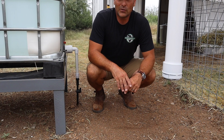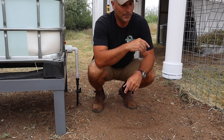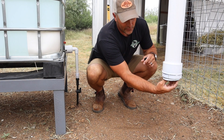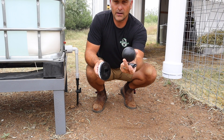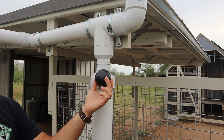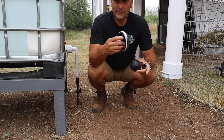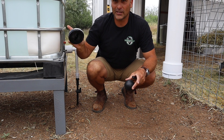For a little more info on the first flush for those who haven't seen my last rainwater harvesting install: the bottom of this first flush pipe has a threaded cap. Within this tube is a little black plastic ball that floats up with the water level and seals right at the connection where the PVC pipe steps down to the smaller diameter. That is what keeps the floaties and silty water from intermingling with the hopefully clean water that eventually makes it into the tank.